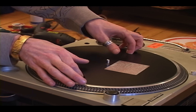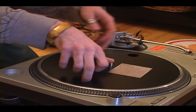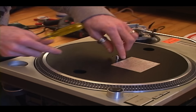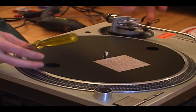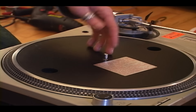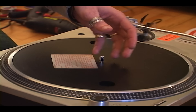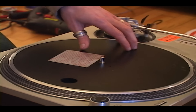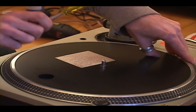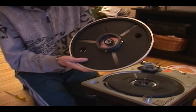The spindle is in its own casing. The correct way to remove the platter is to pull up on it — actually the correct way is to tap on it with a screwdriver because it moves up and down. Some platters, because they aren't removed very often and you push down on them when DJing, can get on there pretty good. Just lift up with your thumb and tap to release the platter, and it comes right off.